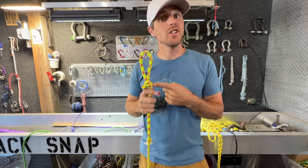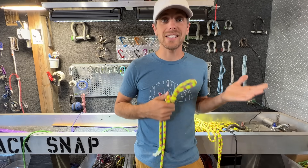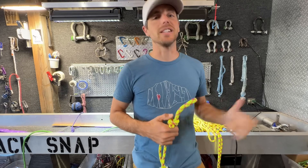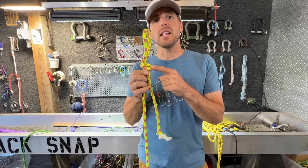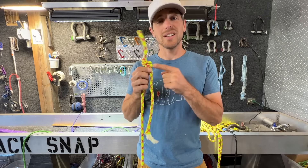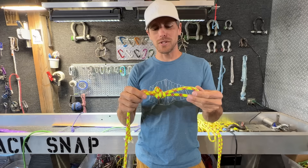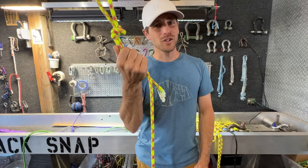If you tie a knot in a very static rope — like high-tech cords such as Vectran and Dyneema — you can reduce the strength by 70%. You can see that our 9.8 static rope, which is clearly abrasion resistant since it's not breaking at the hanger, is breaking lower than our dynamic rope because it takes the bends in the knot worse. When people talk about dressing your knots — at normal forces it's maybe not a big deal, but when you pull to destruction it no longer looks anything like what you tied.